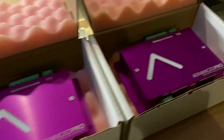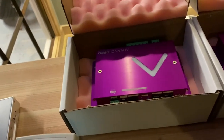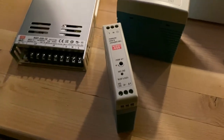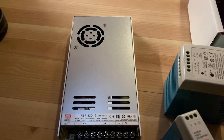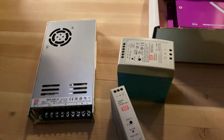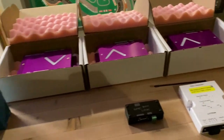An Epic Link is a couple hundred dollars, and the advanced controllers run roughly $400 each. For power supplies: the 60-watt runs the step lights, only a 20-watt runs the star ceiling — which is why I want to do a separate video on how that works — and we have four 320-watt supplies. I'll add some math into the video to give the total 12-volt low-voltage wattage and a better overview later.